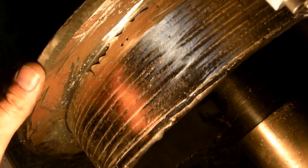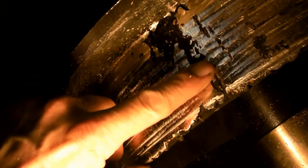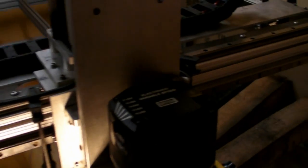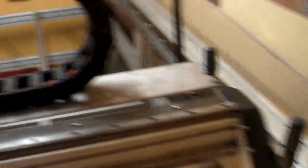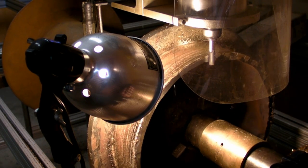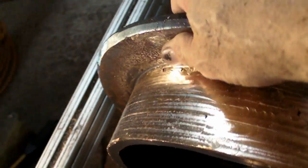It's not smooth, but I don't care — it's a braking surface. It'll get rubbed by the brake shoe anyway. I've got three spots that just need a little bit more weld, and then some more grinding. I've gone to a manual system completely today because I had a drive controller go out on the CNC table. I just clamped the rails into position and that's working fine. I did the outside edge here too, so you can see how thick that layer is. Some places it's really thick where there was damage to the rim — they'd dropped a lot of stuff on it over the years and bent the cast iron in. So not only do we have a flat surface now, we've got one that won't rust.